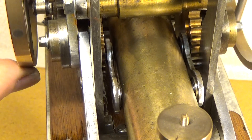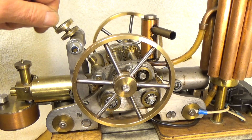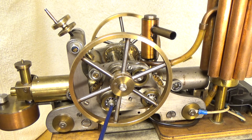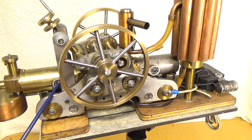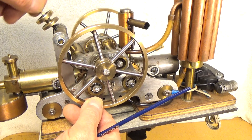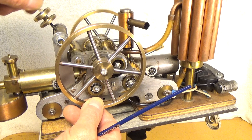This is the other piston — the suction piston. The small gear wheels on their shafts are linked and turnable. I have made a little handle for this, and they are turnable about the large gear wheels' axis. To demonstrate: holding the flywheel tight and observing both pistons, you can see the one on the right travels inward to top dead center while the other is nearly standing still, then moves out again.